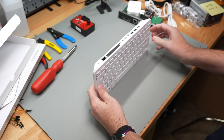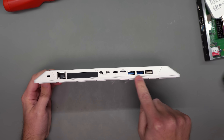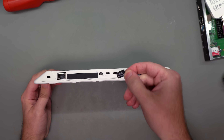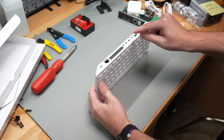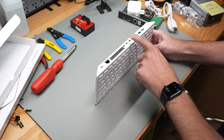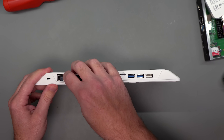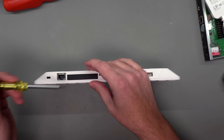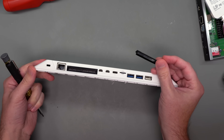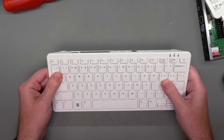Here are the ports. We've got USB-A — three ports here, USB 2 and then two USB 3 ports that are both on their own buses, so that's five gigabits and five gigabits. Micro SD card slot, and it comes pre-installed with a 32 gig Raspberry Pi OS card. USB-C power input that can also be used as OTG mode, so you can plug it into another computer. Dual micro HDMI outputs — those are micro HDMI, which is annoying, but they do have 4K at 60, so that's nice. There's a GPIO header here, you get all the Raspberry Pi GPIO. And then there's one gigabit ethernet.